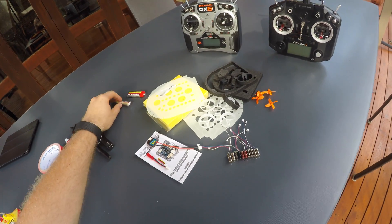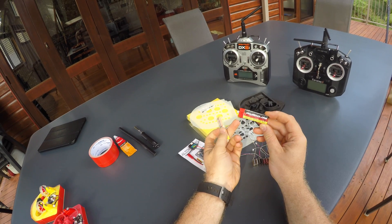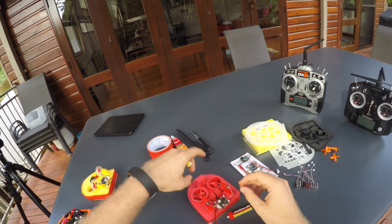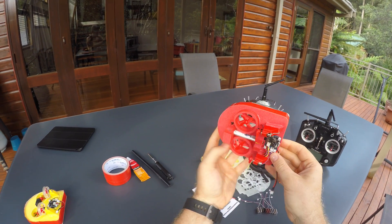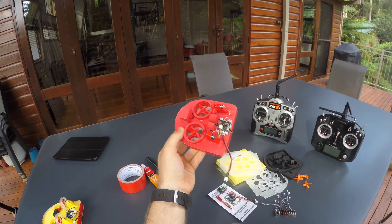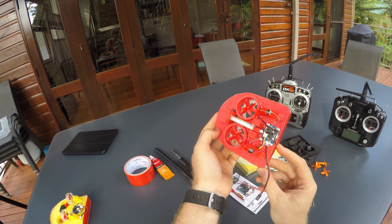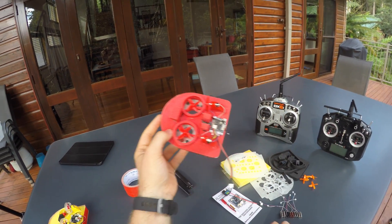Not included in the kit but required are batteries. You can use a lot of different batteries — I'm using 255 and 600 milliamp hour LiPo batteries and I made up a battery holder that fits both of them, but you can use pretty much any battery between 200 and maybe 800 milliamp. A larger battery gives you more runtime, but I also found that it makes it more predictable and smoother with some extra weight.